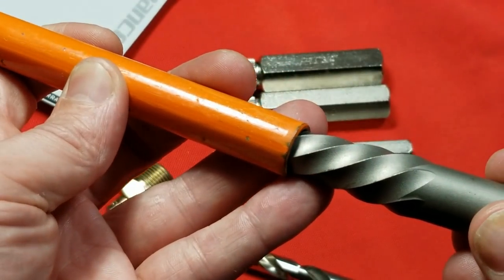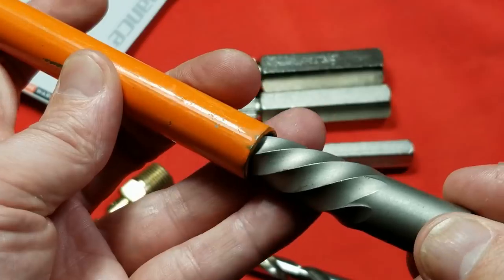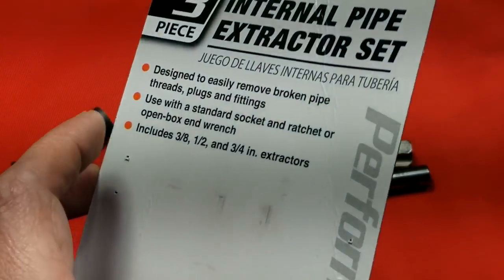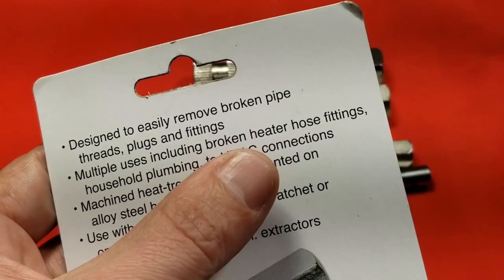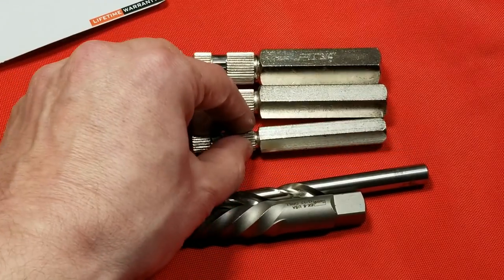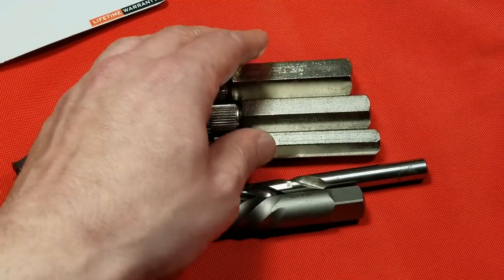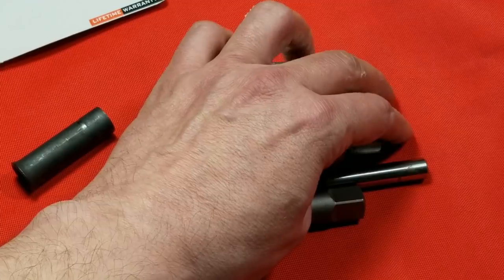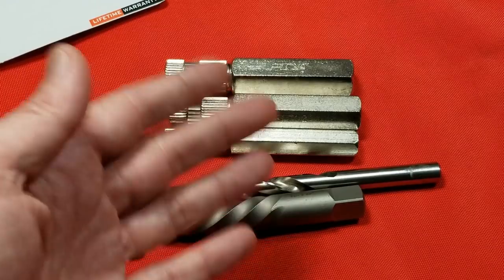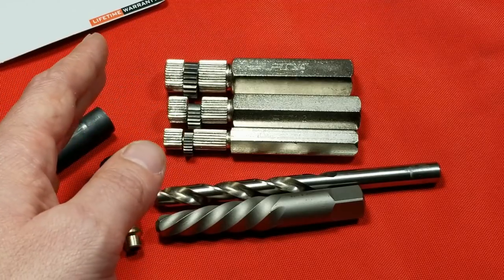We can see on this piece of tubing here that would be a little bit deep, but okay. I wanted to do this review because somebody's going to end up with these having broken heater hose fittings or household plumbing in those sizes, and find that they aren't going to fit. But if you know they're metric and can be used on half-inch through three-quarter-inch — but not three-eighths — then you know what to expect. You'd need to order an individual one that actually works on three-eighths. Anyway, I really appreciate everybody watching and subscribing. Until next time, Catus Maximus out.